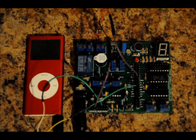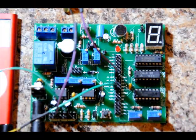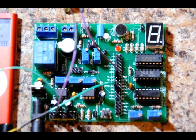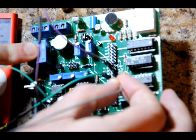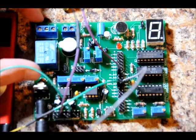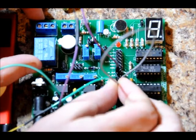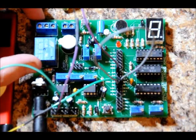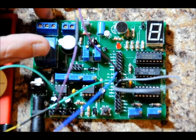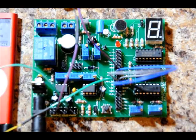We've selected the LDR on the sensor main pin block by using a jumper to short the LDR pins in the middle. I'm going to take a jumper wire and connect the AC pin — the coupled AC output that will be received and sent across by our LDR — and put that signal to our A2-plus pin, which is the input of our second non-inverting operational amplifier. From there, we'll take the A2-out pin, the output of the second audio amplifier, and connect it to the ACT actuator line — that is our transistor driver. Now all that's left to do is connect the speaker.